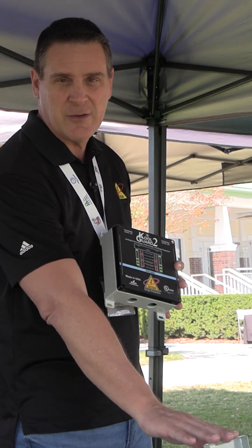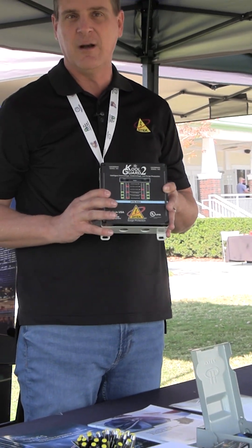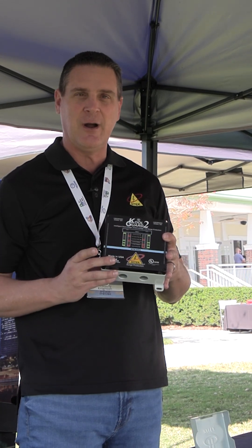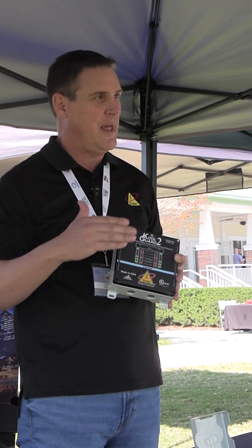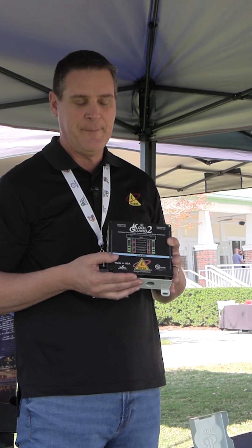Starving those for voltage is very dangerous. Your traditional surge protector only dissipates over-voltages. Your voltage monitor with surge protection is going to react to under-voltage situations — it's going to cut power for 30 seconds, allow the power to regulate again, turn the system back on, and you're up and running.